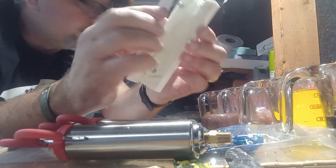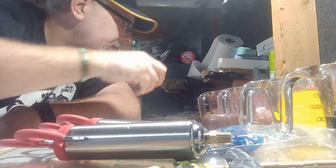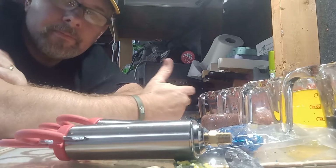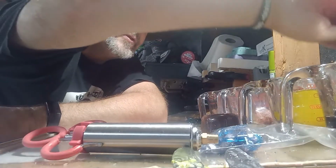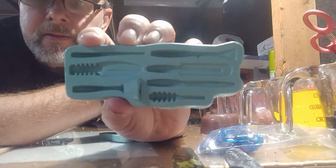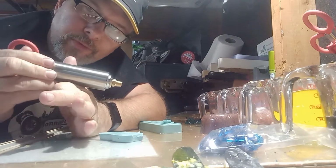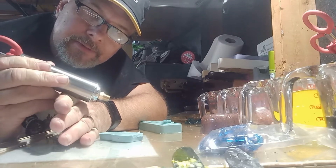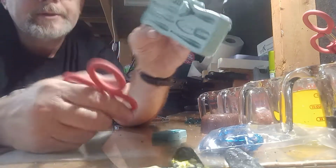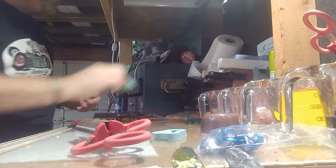So this frog, which is this guy right here, is no problem at all for these injectors. Now, I can set up and run different things and make stuff happen and do some cool stuff. I like these because they're small enough that if I get into fine molds like this guy that have really fine points and tips to them, I can suck it up and really control the amount and pencil it in there and control the flow of the plastics going into these really fine points, especially this one right here. That guy, I always have to trim up when I do it by hand.